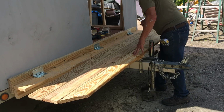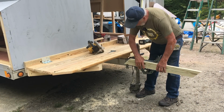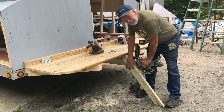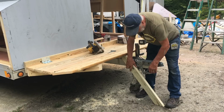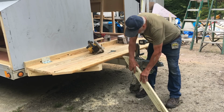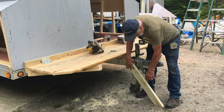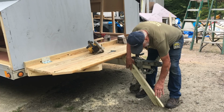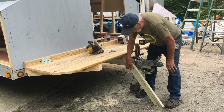Okay. So now I'll get some support out here. I've made the stair stringers, cut them to length. They're going to just set, they're not like regular house stairs where it's fixed. If the ground falls away more, it may be a steeper step, maybe a little less, but it'll be pretty close to that. So I've made equal marks for the stair treads based on ground 1, 2, 3. So it should be a nice even step going up through there.